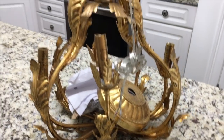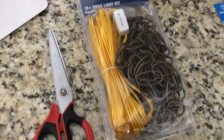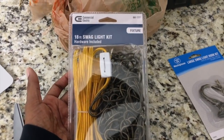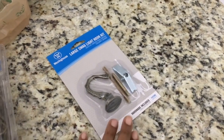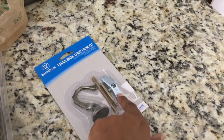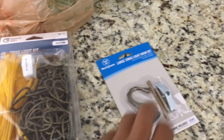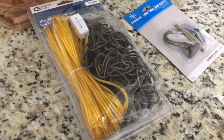It's going to be perfect because it's not too big, and I was just worried about it being too heavy since I'm hanging it from a drop ceiling. Here's what I'm using: I need some scissors, I picked up this swag light kit from Home Depot for about $17.99, and then I also picked up this swag light hook kit because I needed this butterfly anchor — I'll be drilling a hole through the drywall and I need this to anchor it for stability before I hang the chandelier onto the hook.